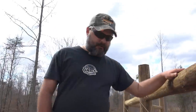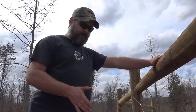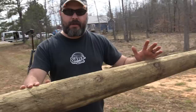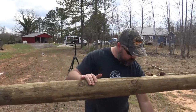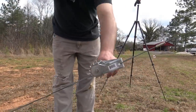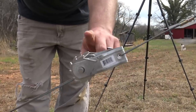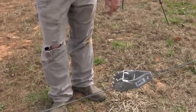Right here is the starting point of the brace. This point right here will be where our gate is, and this is where we'll start pulling our wire. The thing about braces is they are what really supports all the tension of the wire, and you want a way to add tension over time because things do move. This is an inline strainer, a ratchet strainer. You can tension this over time as things start working loose.